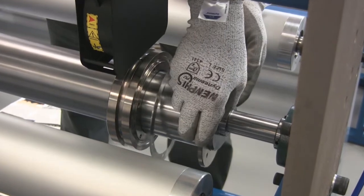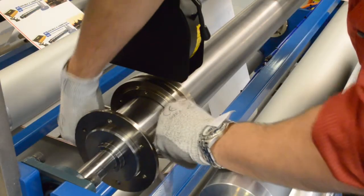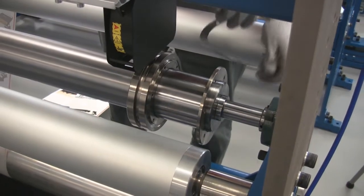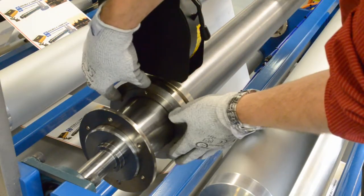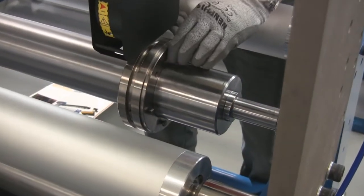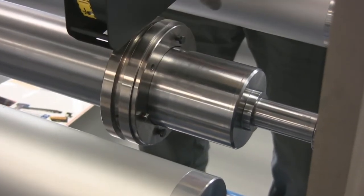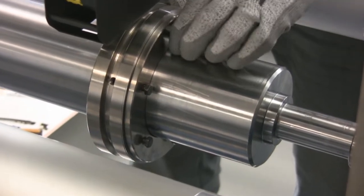The Expando Anvil is designed with a removable cutting surface, the Expandette Ring. The Expandette Ring is made of M2 high speed steel and is laser cut to allow it to break and flex over the knife shaft. The Expandette Ring is locked into place with a clamping rim and the machine is again ready to be run at peak performance. The Expandette Ring requires no resharpening — simply use both sides and discard the ring. Because it is made of M2 steel, you can expect much longer anvil life than from a traditional 52100 or D2 anvil.